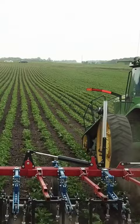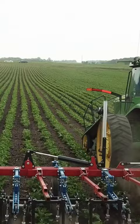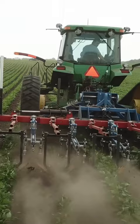The camera stands up off the cultivator toolbar looking down at the plant row, in this case soybeans. It communicates to the camera guidance hitch which moves the entire cultivator side to side. What this does, it allows the tractor to drive a lot faster, maintaining a higher level of accuracy.